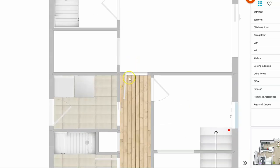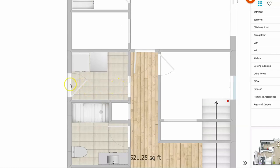Normally this door would open into the room, but because I have a closet here, I just preferred to have it opening out, and that should be fine with this hallway width. First, here is the mudroom. We have a 36 inch door that is existing right here, and then the washer dryer like I showed you. Then this is going to be a pocket door, that way I can keep it out of the way and I don't have to worry about it swinging in or out into this hallway. I'm planning to have that be a solid slab door to help with sound insulation.